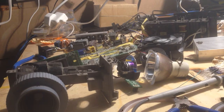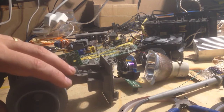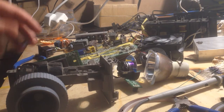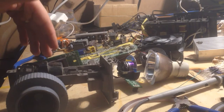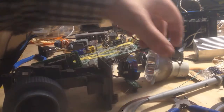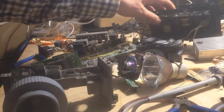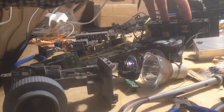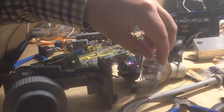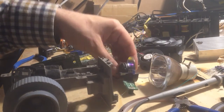This is the optics — the lens to focus the image that's reflected off the DMD, which sits behind it here. There's a light source over here; this is the high voltage — I assume it's high voltage, presumably high current anyway — supply for the lamp, which I think is a mercury lamp of some kind.